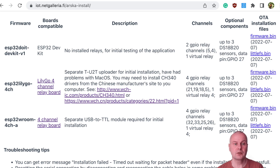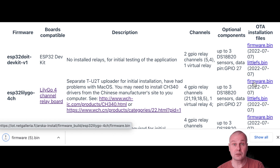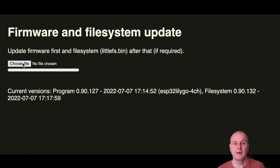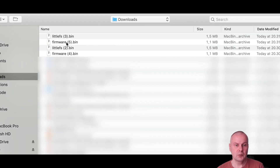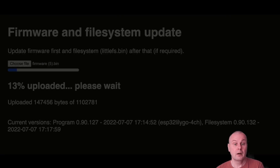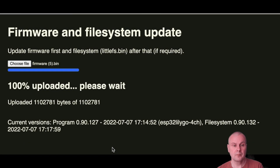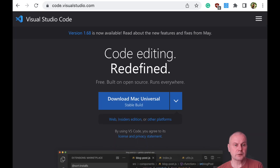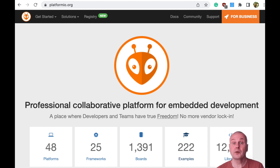After the first software installation, you can upgrade the software without a cable. You just need to update two files: firmware.bin is the actual software and littlefs.bin is the file system. First download the latest files to your computer. Then go to the firmware update functionality from the admin page and upload the downloaded firmware.bin. The system will restart and next you do the same update process with the file system file. The device is now upgraded and you can check version numbers and dates from the bottom of the admin page. There are also some troubleshooting tips at the bottom of the installation page. You can also build and upload the software from source code — for that you need Microsoft Visual Studio Code and PlatformIO, which you can download for free.